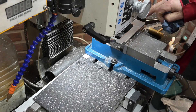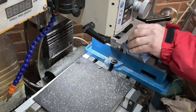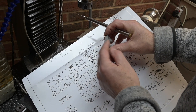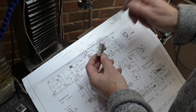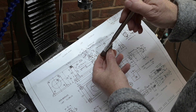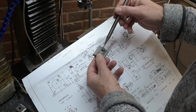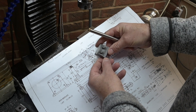Very good that surface — I'm afraid not as good as I would have liked. What I'm going to do is just face off this casting; it's a bit fat at that end compared to this end. So I'm going to get it to the minimum point, which I think is this corner, and just face it off and clean it up so they're fairly uniform. Then eventually I will split them — that split line is not really center but I'll work that out in a little while.